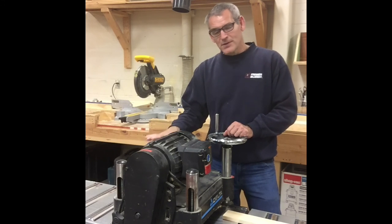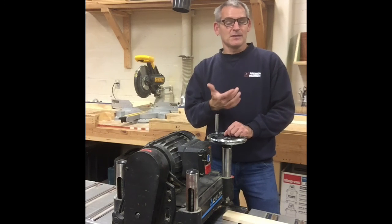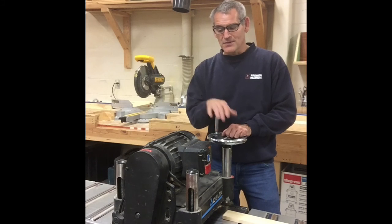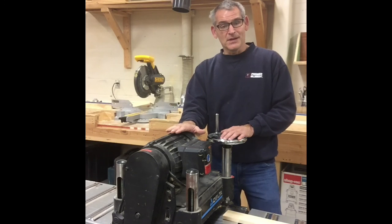This planer has a slow speed of about 16 feet per minute and a fast speed of about 30 feet per minute. If you have it on the slower speed, it's not having to cut as fast, so you could maybe take a slightly larger cut. The slower you put something through at the same thickness of cut, the cleaner the cut's going to be — the slower you go, as long as you don't change other variables, the cleaner your cut should be.